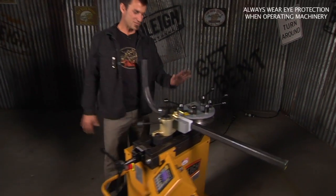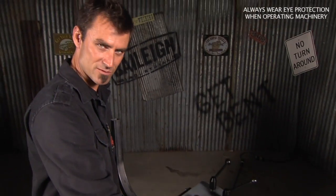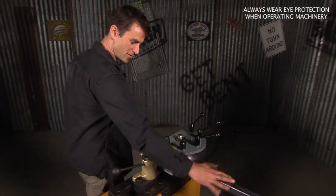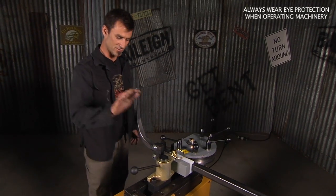So it's got an electric motor in it, it's not hydraulic, and what that's going to allow us to do is use an index table on the front. Whereas on a hydraulic type, you notice that the bar was moving — this bar will stay still. The electric motor will pull it around nice and accurately and fast, and it's got the normal quick change.